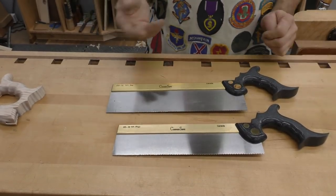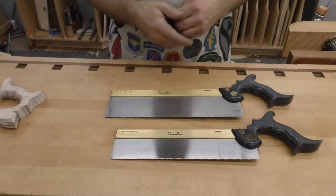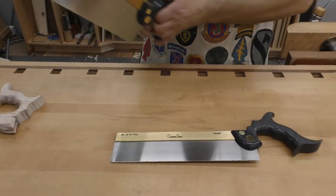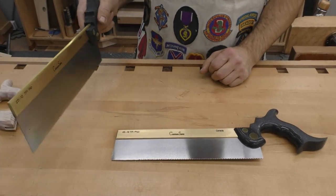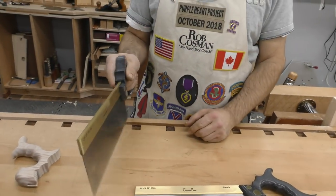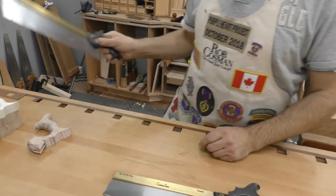The actual cutting face of the tooth is relaxed a few degrees to make it a little bit easier. If you're not used to doing this a lot, it takes a while to get good at a saw like this when you're moving that much wood. The farther away the tooth line is from that heavy brass back, the more wobbly it's going to be. Most folks don't do this enough on a hobby basis to develop that kind of stability — that's the reason why we came out with the medium tenon.